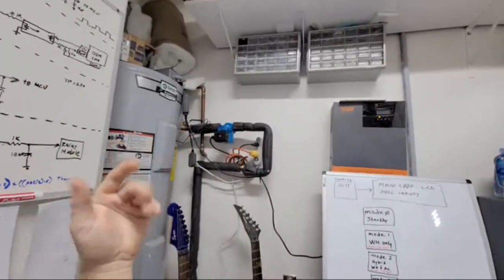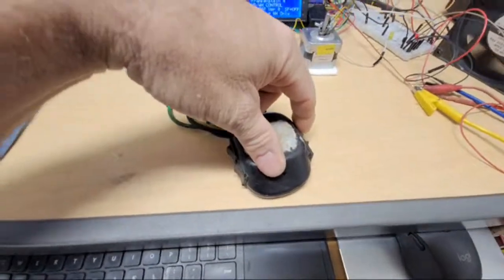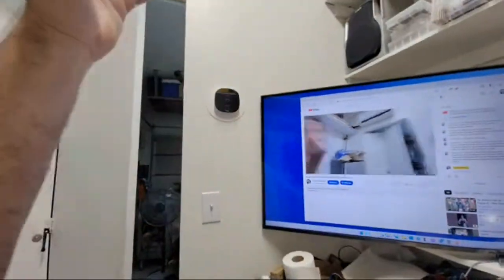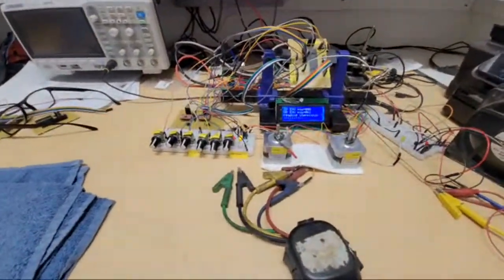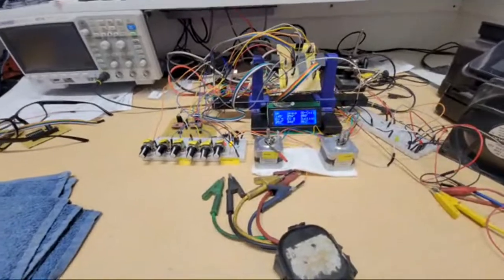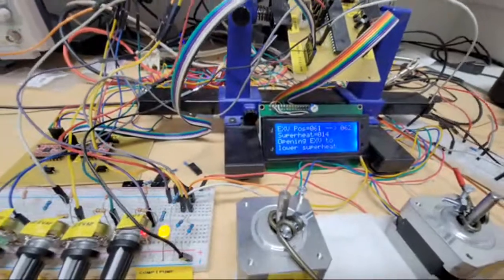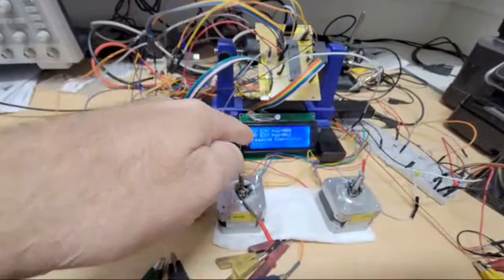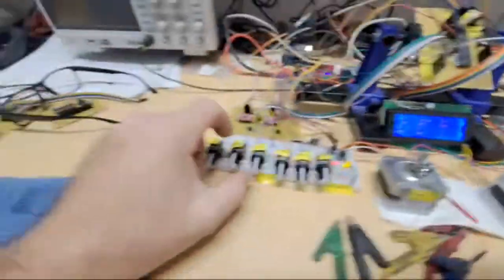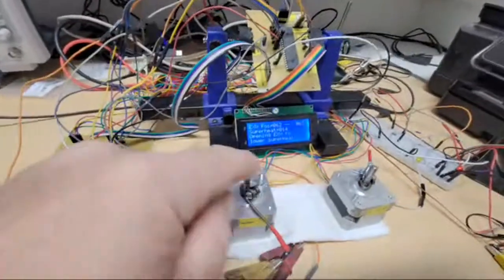And then eventually there will be a high limit on that where you don't want to overheat the water. So I'm going to have a sensor in there for that. And then the one in the room, likewise. If I'm only heating the water and say this is set back to 80 because I'm not home or something, it's going to say, go ahead and cool the room until it hits a low point, like 72 or something. So that's the space temperature one, which right now is going to be like 60-something, right? The next time it reads right here, space 55. So I'm just going to crank it up, so it's kind of way up there a little bit. It's going to switch modes again.